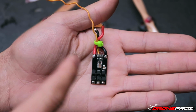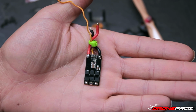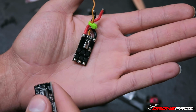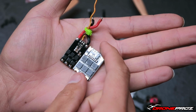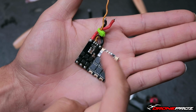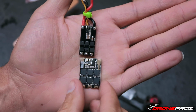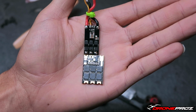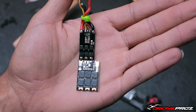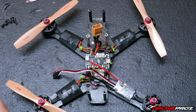because both flight controllers I had, the Rev 6 and this flight controller, use high voltage, so you can run straight power from the distro board right up to the flight controller. But I'm going to put the KISS ESC just to the right of this so you can get a size comparison of it. I'd say it's pretty much the same length that way. I'd say maybe half a millimeter longer, but it is just a bit wider as well. Not a big deal. I'm sure it'll fit on any racing frame out there, whether you go with like a QAV or alien frame. There's tons of frames out there. I'm pretty sure you're not going to run into any issues. It went onto this arm without any problem. It could actually still have been a little bit wider, and you wouldn't have had any issues.